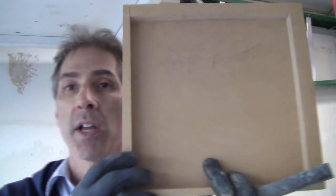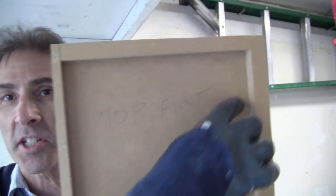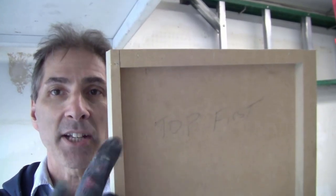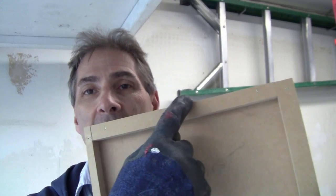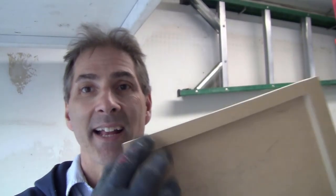I had a hell of a time trying to do it. To give you a comparison, looking at the back here — notice how much material I took off of this one. This is what it's supposed to look like, closer to this thickness. You can see how much material I took off while routering this section down. When I put my build-up strips in here, I put them in with glue — Titebond Type 2 in the center — and I also stapled them in that way.